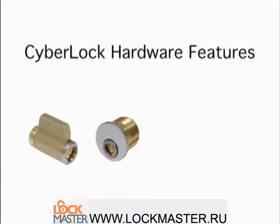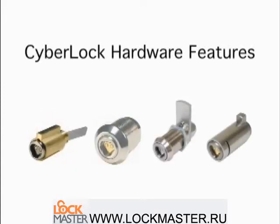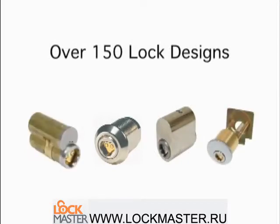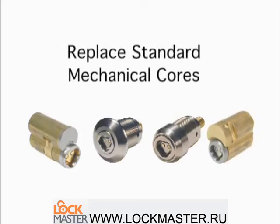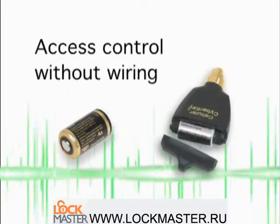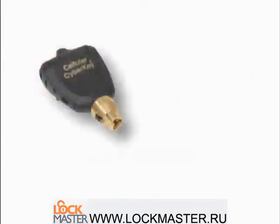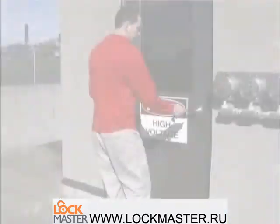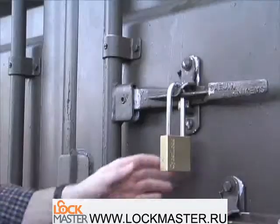What are the most important features of CyberLock hardware? CyberLock technology has been incorporated into over 150 lock designs. These electronic cylinders are the exact dimensions of the mechanical cylinders they are replacing — no wiring is needed. Power is provided by the battery in the key. CyberLocks cannot be picked and CyberKeys cannot be duplicated. One key can be used for an entire system: outside entryways, inside doors, cabinets, and padlocks on containers.